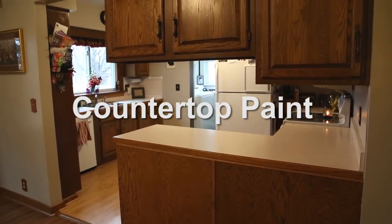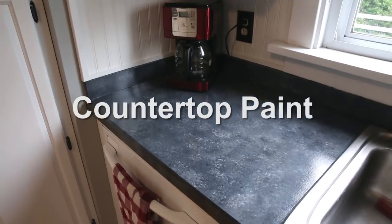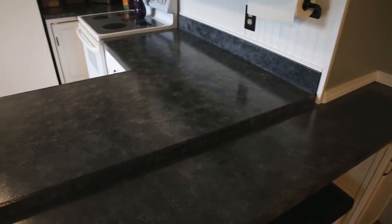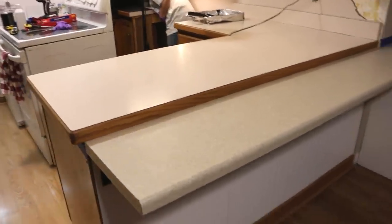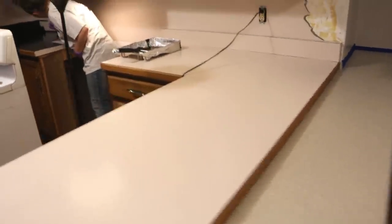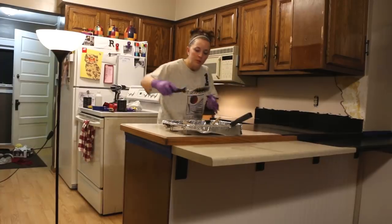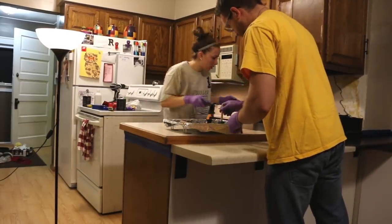What we're going to do here is take this old counter top and make it look like this nice granite. It's going to have a nice glossy shine. You're going to be able to find this product in the description below — essentially it's paint with a gloss on top. What we're going to do first is make sure your counter is nice and clean. Any oils or anything, make sure you take off. Then you're going to take this black primer and put it on all the surfaces that you want to look like granite.